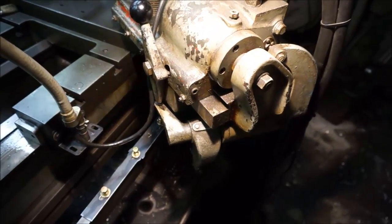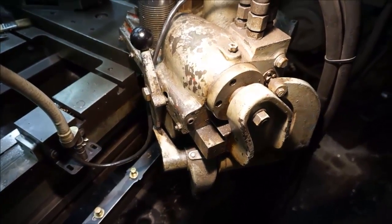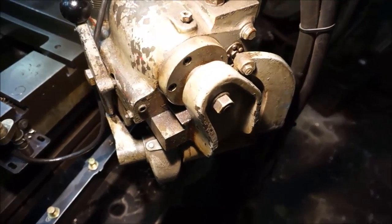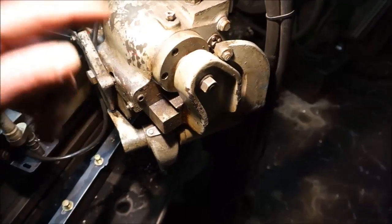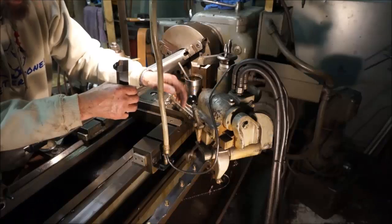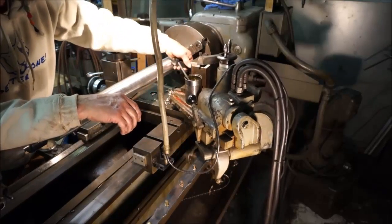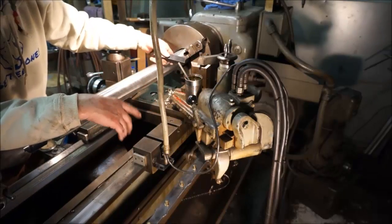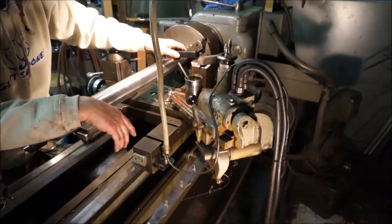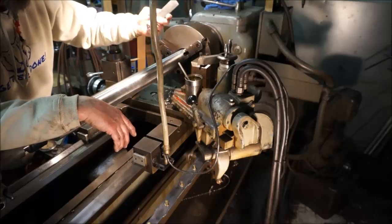That minimizes the old myth a lot of people gave tracer attachments, because they don't maintain them—they didn't change the fluids, clean the filters, things like that. Let's get back to the regular program. I just wanted to grab a little footage to show you that this arm was controlling a spool valve that controls the flow for the main cylinder. The control is all there and really, with it being as simple as that, we just need to put the tool bit in. I'm going to swing you around so we can talk about my tool post and what I've done to control a couple of different positions.